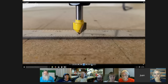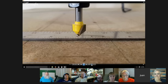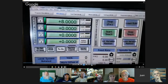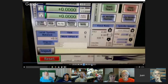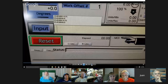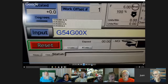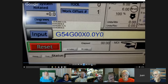So if yours is having some kind of problem and it's not where you commanded it to go, this is the process that you would take here. As you can see on the DRO, X is supposed to be 8 inches, and it's not. So I'm just going to take it back to zero so I don't have to re-zero it every time before I do the adjustments. I didn't have to put the Y, but...